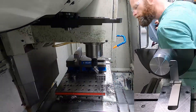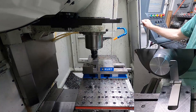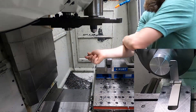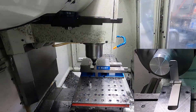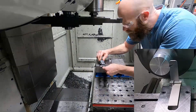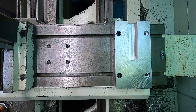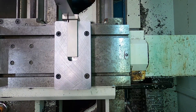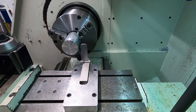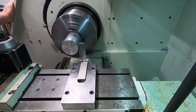I do like to try different things out and see how they work. I could have bought a standard y-axis blade, but I went ahead and made a different style — one that would have the forces pulling on it rather than pushing. But when I tried it out, it didn't work. What wound up happening was that it stretched open the opening that held the insert, and the insert fell out.